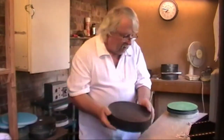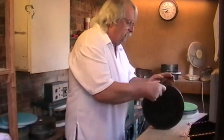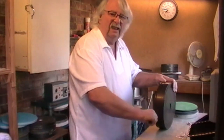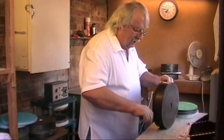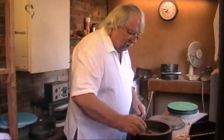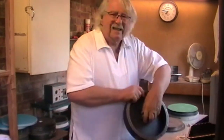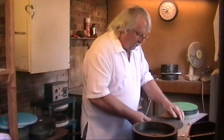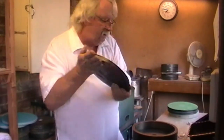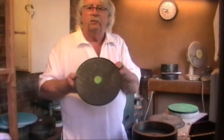we have the casting pan, which is a rather large, heavy piece of steel. Once you've got it apart, you've got the two inside, top and bottom, and a large ring, which is a mushroom, which actually forms the cavity in the middle of the mould. And you have a flat top, and then what we do, we get our mould, which is a blank,